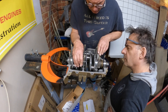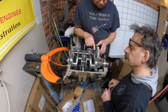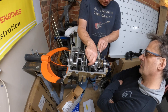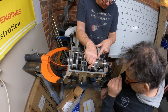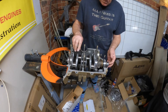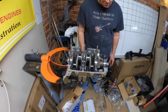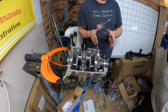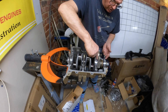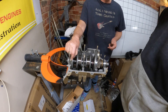You can see it here coming off the gear. We want to check for play that way too - make sure we have enough clearance. So that would mean to me that this gear is probably too big, or there's an issue with the teeth. You have to check your teeth, see all the edges - have they been skewed? See that one there - you might file all those ones nice and clean. Basically the cam gear is in a different position to where it was originally just running at that edge, and now it's taking the full teeth out. These little corners that have been knocked need filing.